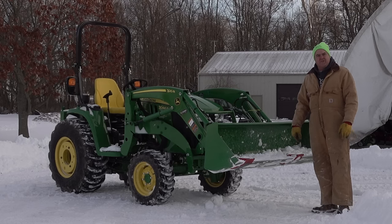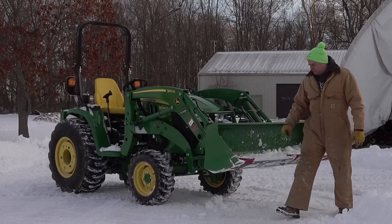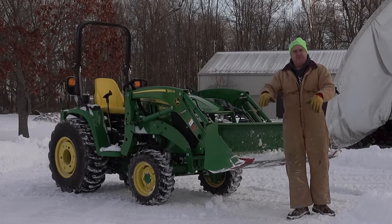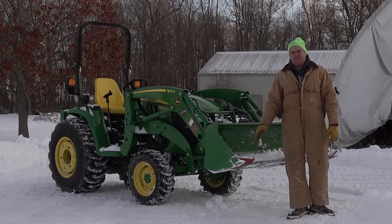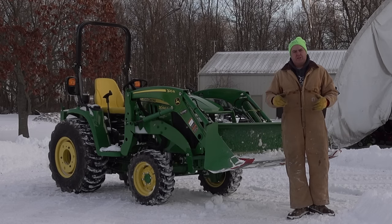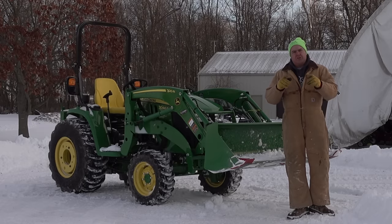I wanted to try these edge tamers. I've got three of the four-inch edge tamers on it, and they're working beautifully. You can even put a little bit of down angle on the bucket and still not pick up any rock. I have a lot less trouble picking up rock with this than I do with those blades. The blades I showed you in prior episodes — I just have trouble keeping from picking up rocks with them. So we're going to show you some more of this. Let's get started.